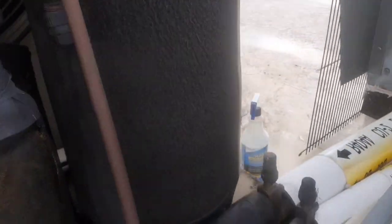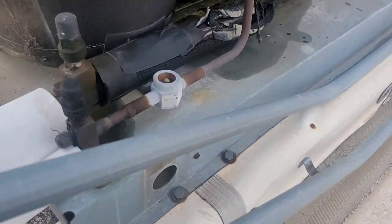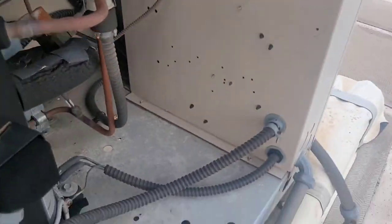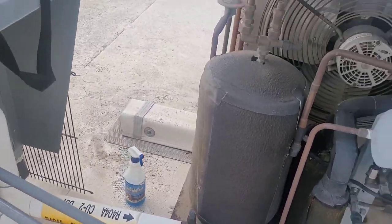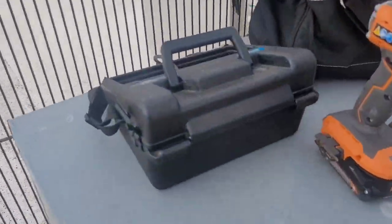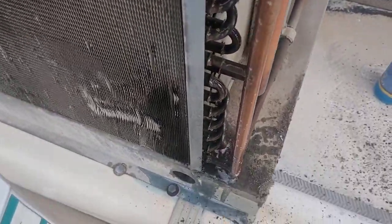When it does come on, the sight glass here is just empty - nothing in it. When I had it turned on, the sight glass had hardly any refrigerant in it. Symptoms of a low charge: the compressor will be hot, and short cycling on and off within five to ten seconds is a quick sign. So I got my trusty H10 and this thing picks up on leaks immediately right here in this corner, and you can actually see the oil.